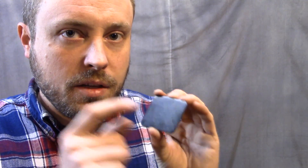That super thin layer of selenium dioxide and oil creates a very complete barrier over the surface of the steel. It doesn't let oxidation happen to the steel underneath, and it's also very resilient. People use this because it's an extremely thin layer — if you put paint on a tight-tolerance machined part, it changes the tolerance, but this coating is crazy thin and doesn't. A lot of people believe that coating is hazardous to your health, but I don't think it is. Selenium dioxide is very dangerous and toxic to humans in very small quantities — so why do I think it's safe for food?